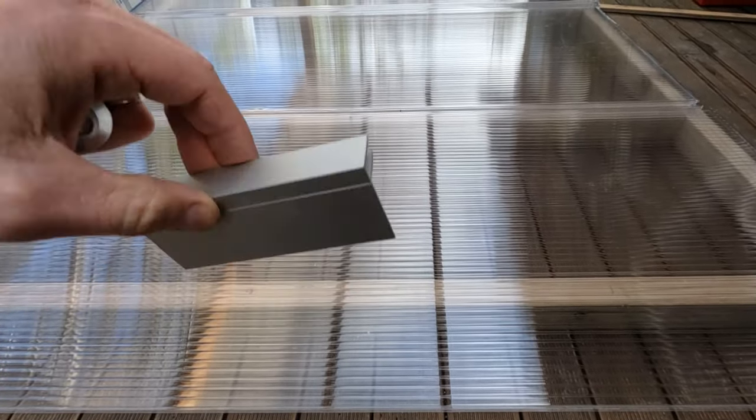And you put the twin wall fasteners every 400mm along the rafter. Before you put that in, you want to use a 10mm drill to drill an expansion hole first, just to give the sheet a chance to expand and contract.